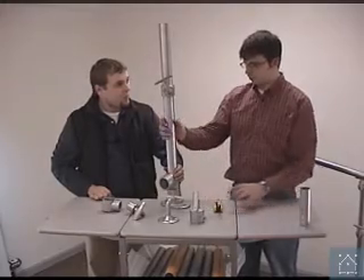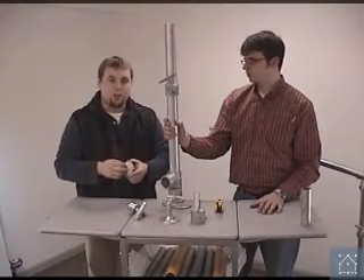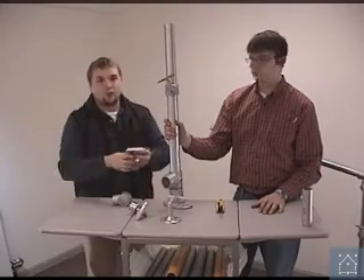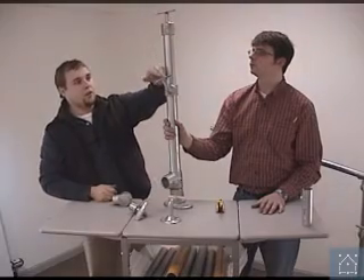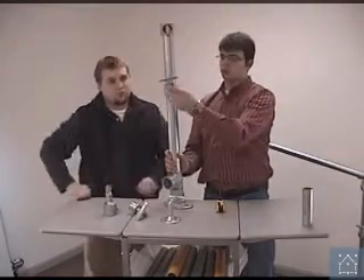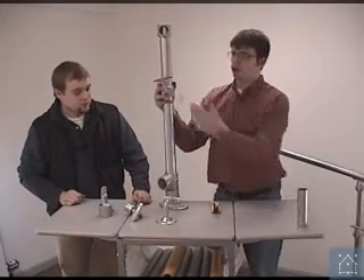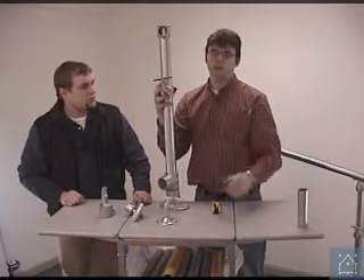When we go to attach the rail at the top, the most common way to do it would be a fitting similar to this — but instead of being hollow all the way through, it has a cap built onto the top so that you don't have water going down inside your pipe. Another option is a fitting that has a spot for the railing to sit right on top, making an actual inline system for the top rail, also complying with ADA requirements. You'll notice these fittings have holes in the bottom — that's because for an ADA railing, the railing surface needs to be completely flat and smooth, so you can't have a fitting that wraps all the way around the pipe. Those holes allow you to use a standard self-drilling screw to drill up into the steel pipe.